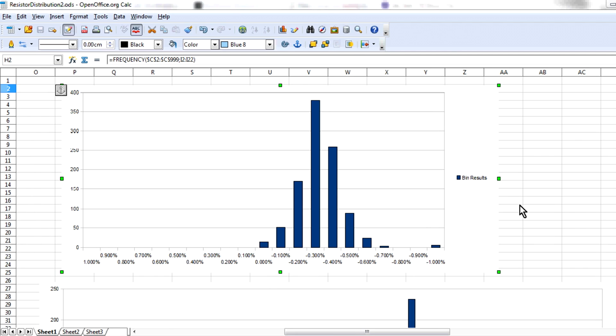And naturally, of course, there are a few people in response to the previous episode were mentioning the fact that I didn't mention standard deviation, and I don't really want to get into standard deviation. The response is pretty much what you'd expect if you get what's called a 6 sigma response for 1%, especially if it was centered. If you remember the previous blog, then basically the sigma response and how many sigma you design for will dictate the probability of getting a resistor with a value right out at these limits right out here. And that's probably what Phillips actually designed for.